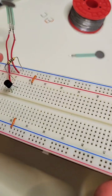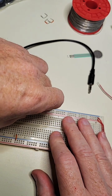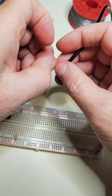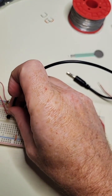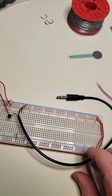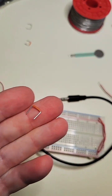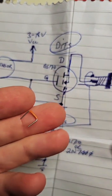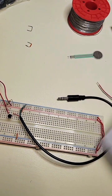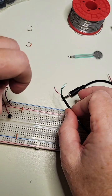Rail 17 - this is the thing with a breadboard: if you solder it then you have to unsolder it, but if you use the breadboard you get it all laid out and working properly. I plan to hook it up and run with it for a bit before committing. I need to connect the source pin to ground. The source pin was pin 3 - but I need a longer wire for that.